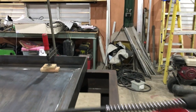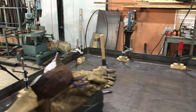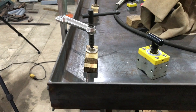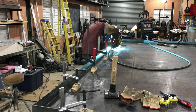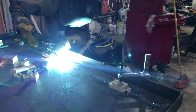I just slid the sheet over so that the seam is over the frame underneath, and I've got it clamped all the way down holding both the angle iron and the sheet, done on this end as well. You can see the sheet is over the bottom frame, and that way it will hold everything nice and flat. I'll get tacks on all of this, then slide the pan over and do that to the other two sides.